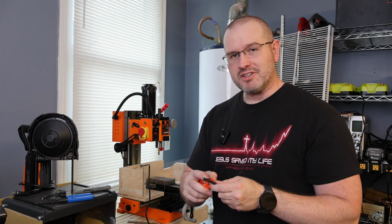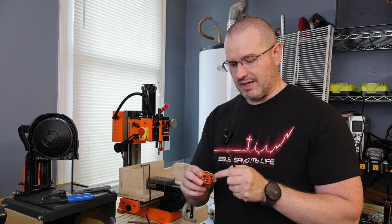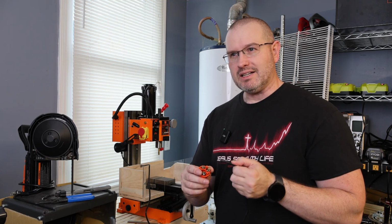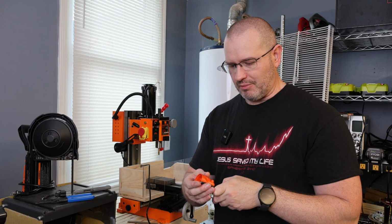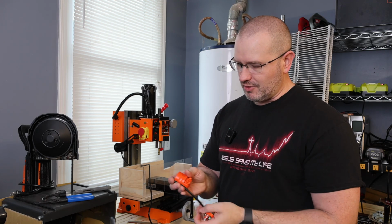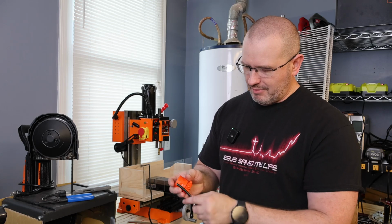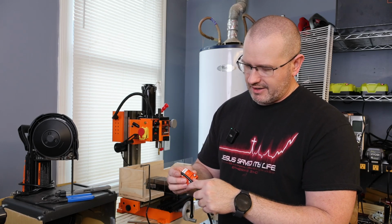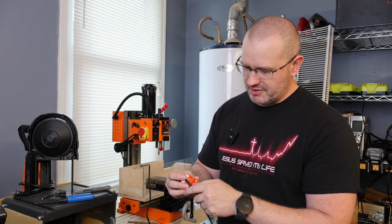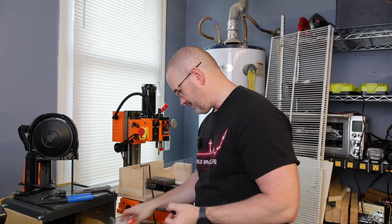Now the outer insulation, we want to strip back enough so that we can get to them and each wire can get to here without being pulled on. We don't want that excess stress. So if you're wondering how much to do, you can always take your cord here and say just a little bit shy, maybe about to the point where this split is right here. Give just a little bit extra and say, okay, I'm going to strip it right here.